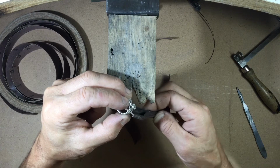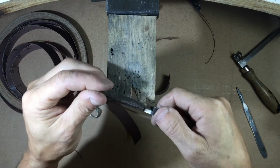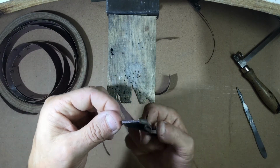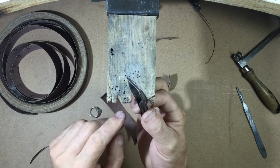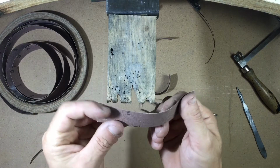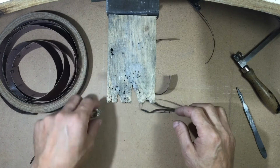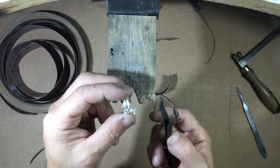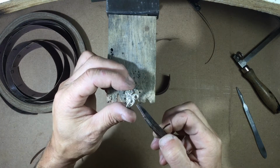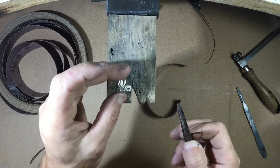When this piece wears out, all I do is I open my cross-locking tweezers, push a little bit in, and then I have a fresh piece of sandpaper. Anyways, I hope this helps. You can use different grit as well, of course. This stuff is the cloth sandpaper. It's much more flexible. I prefer this, but you can get into almost any groove. So you can either use your saw frame or you can make yourself a pair of cross-locking tweezers like this, and that'll just let you get in there and sand all of those little spots that you can't normally get at.